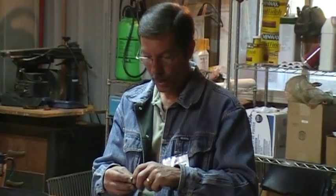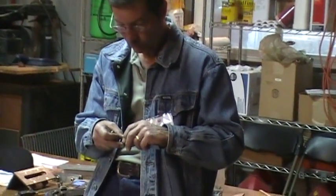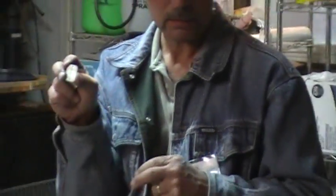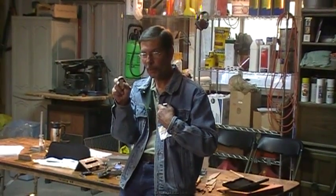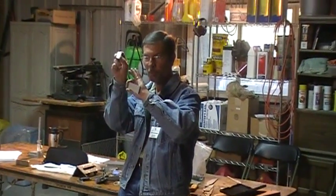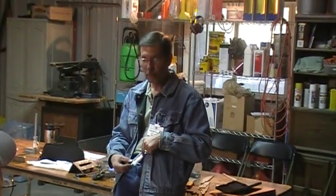So I'll pass this around and you can look at this while I talk about it. One of us is going to drop it — I already dropped it. That's why I didn't spend a lot of time putting stuff in. The pins I super glued in, so you can take this apart. But you'll notice on these assemblies, one thing you need to do is mark all the parts for the way they go, or you're going to lose track. My own personal process is I put a punch mark on the back left side of my fittings. The ones toward the front are number one and have one punch mark, and the ones toward the back are number two and have two punch marks. Everything's punch marked so I know which way they go, and the insides of my aligners are scribed both left and right.